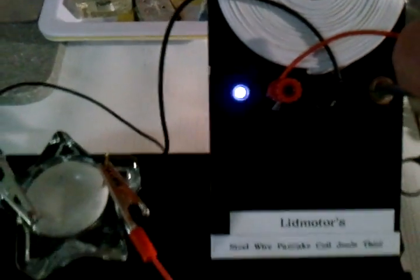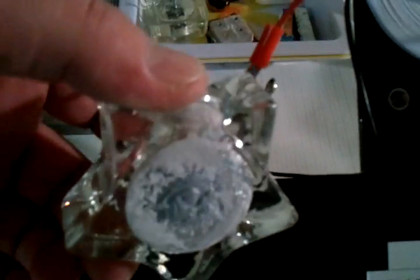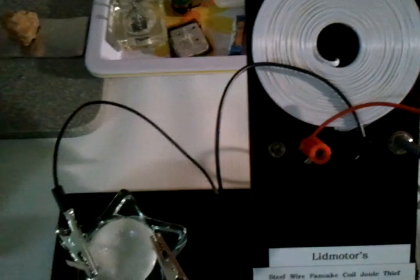Let me show you what I did a little bit different on this cell. I did use the foil in the bottom. But then I added zinc oxide and antimony — this is the antimony here. I just filed a small amount into the mix and added just a little bit of zinc oxide. I went ahead and cooked it the way IB Pointless shows to cook his stove top cell, and then I put a little white glue on top just to seal it. You can see it's running very well.